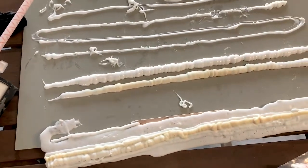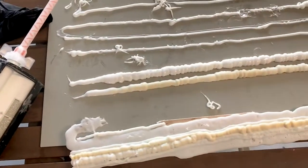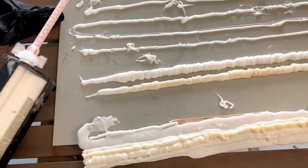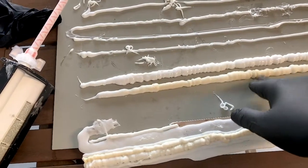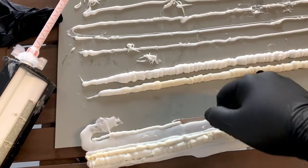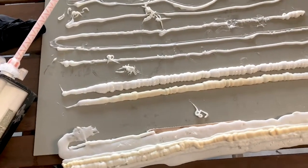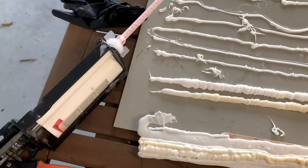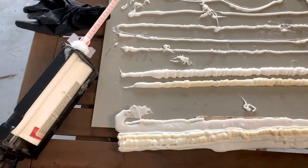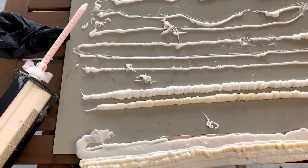And it stinks too. This is actually starting to burn. And if it was seriously overdosed with hardener, and if it was in a much thicker section than this, there is actually the possibility that it could catch fire if it gets hot enough. Shouldn't really ever get a mix that bad out of ratio with a cartridge system, but it is possible, so something to keep in mind.